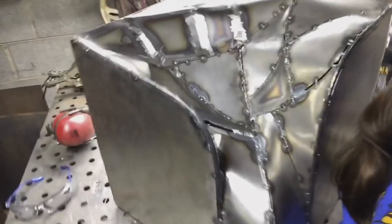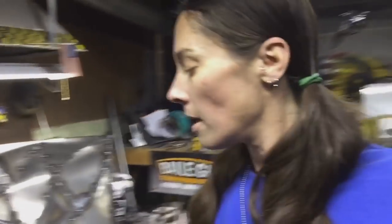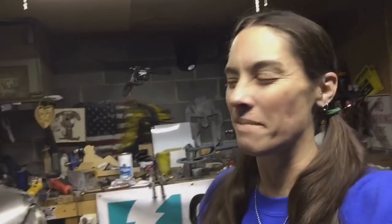So I am filling in this gap instead of cutting another piece of material. I have filler rod and a 3 sixteenths gap. And to add to the melee, I am going from 16 gauge steel to quarter inch round bar. I'm going to show you guys how it's done — no more complaining to your fitters about stuff not fitting up right. Learn to work with what you got, make your stuff work. Alright, here we go.